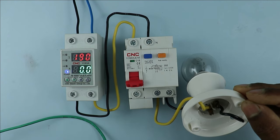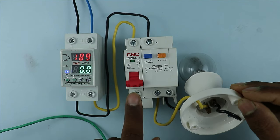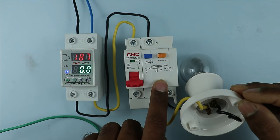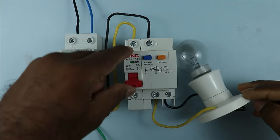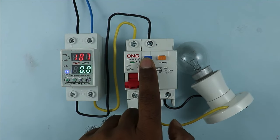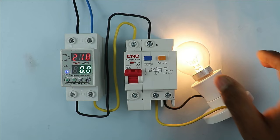You saw the sparking — don't try this yourself. Just for explaining, I took a risk so you could see it practically. When earth fault happened, this MCB here got tripped — RCBO got tripped and MCB also got tripped, meaning you have complete protection. Now if I try to turn this on, it will not turn on. To reset it, press this push button here. After getting reset, when you turn it on, you can see power supply to our home again turned on.